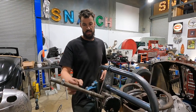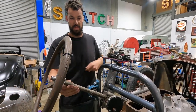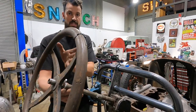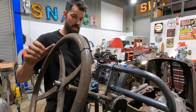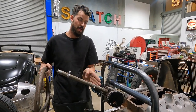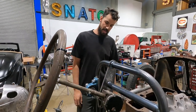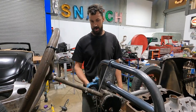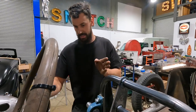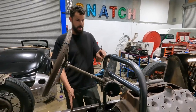And it's so nice to be able to use this, because I can just stick the steering wheel on, bring this in, slide the clip down, and then I can set the height of where I want everything. So then when I go to use the original one off this box, I can cut it exactly to that length. So it's really nice to have that. But that's Pitman arm, finish welding, and then I will probably end up trying to tie this into something else. I'm not sure if I'll make another hoop directly beside it right here. I haven't got that far yet.